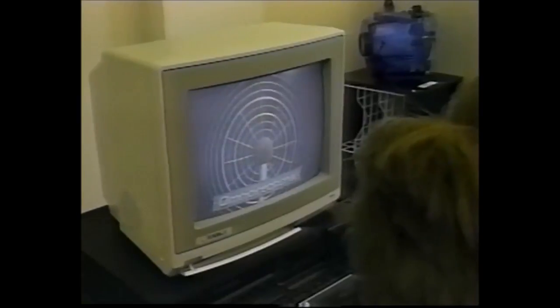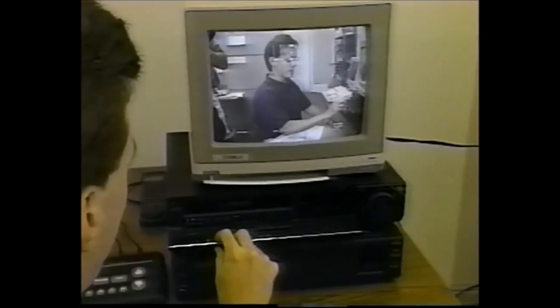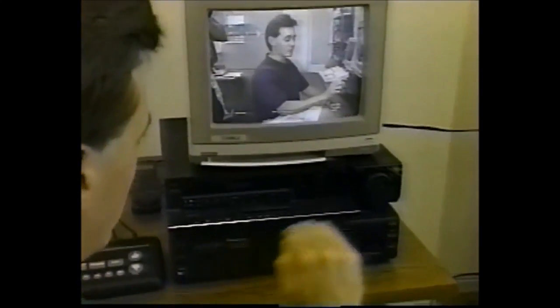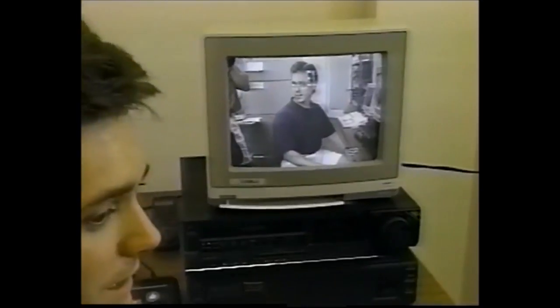Now, let me contrast that. Whoa, we still got more. Okay, so it was struggling to regain the sync because the control track was stopped. Okay, so if I hit stop here now and press play, you'll see that the end of that edit is clean because the control track was unaffected. There we go. We came in and right back out again. I see. Insert versus assemble editing.